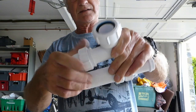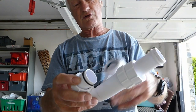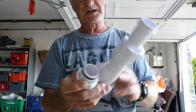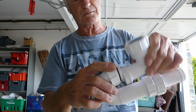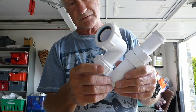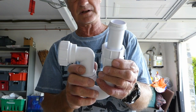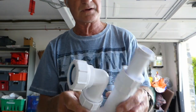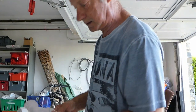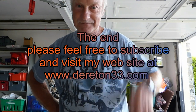Don't forget that on this waste type there's another washer if you split it — that could also leak, so something else to look out for. Dry everything off with some kitchen towel and trace where the leak is coming from. Before replacing any washers, try giving the joint a little hand-tighten first — sometimes it's just loose and a tiny nip will stop the leak, saving a lot of hard work. I've gone to people's houses and found it was simply loose — job done. Something I've learned over the last 40-odd years. Anyway, thanks very much for watching. Keep watching — thanks, bye.